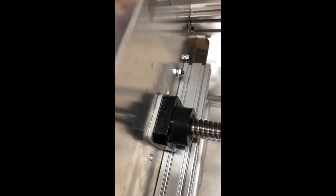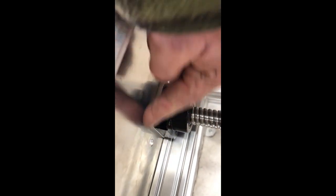They're only in loose right now because they'll be adjusted — there is some movement for adjustment. I'll leave those loose until I get the gantry on, and then once the gantry is on that will get snugged up in the correct place. One thing to note: on the back end there is a shim. That shim must be in there, otherwise the ball screw doesn't fit properly — it'll be sloppy. That shim is the perfect distance, bang on, so just remember that shim right there.